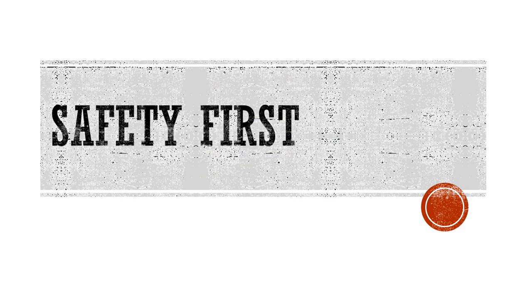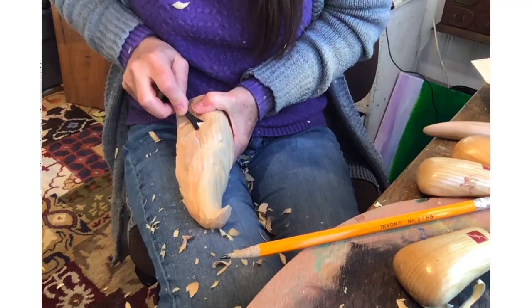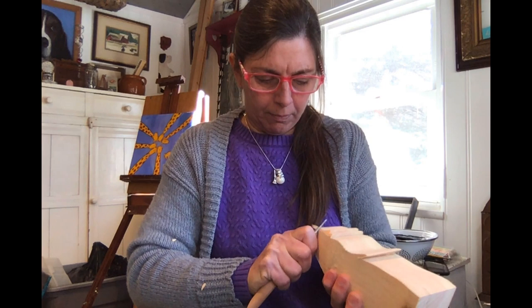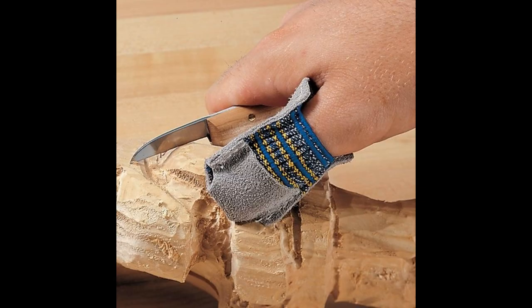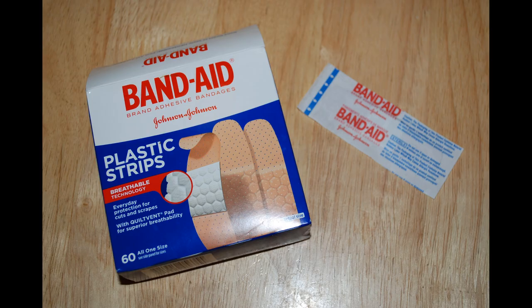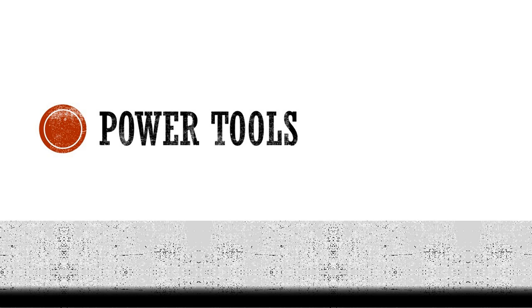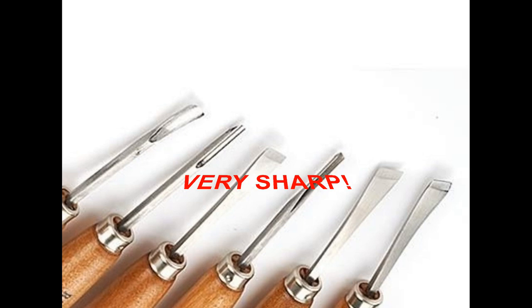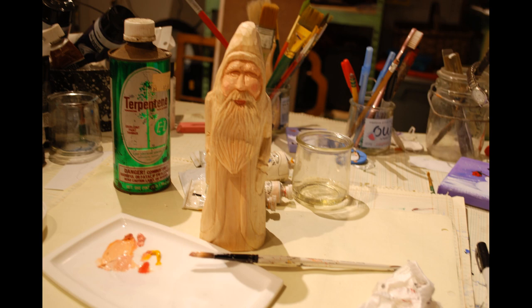Once all the supplies are gathered, we must consider a few safety points. First and foremost, the carver must keep in mind that chisels and knives are sharp and can easily cut the skin. Always cut and carve away from the body. Special gloves and thumb protectors are available for carvers who hold their pieces in one hand while carving, but these do not always guarantee there will not be cuts. Keep some band-aids handy just in case. If using power tools, it is imperative to pay attention at all times and keep fingers out of the way of blades and moving parts. If a chisel were to fall from the workbench or out of your hand, let it drop to the ground — trying to catch a falling chisel could result in a painful slice across a finger or hand. When painting and cleaning, it is a good idea to work in a well-ventilated space and follow manufacturer's directions.